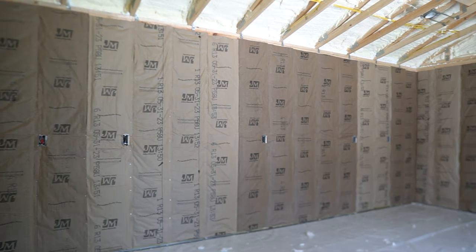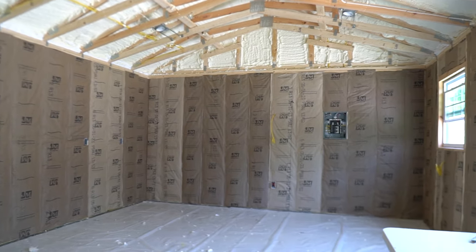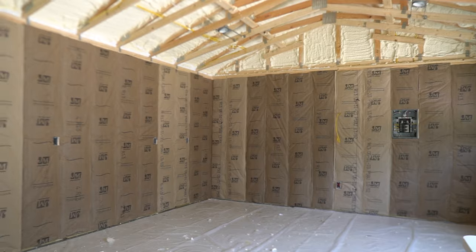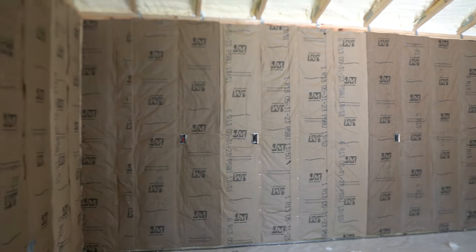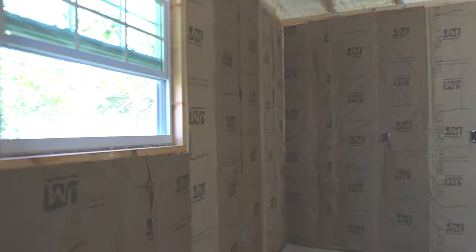Before hanging drywall, some prep work is required. Go around the room to make sure any staples, nails, or screws aren't sticking out of the framing and to ensure no insulation is in the way. If you need to add any additional blocking, now's the time to do it. Make sure your drywall has a place to start and stop on a stud or backing. Lastly, make sure electrical wires and plumbing lines are covered with nail plates where required.